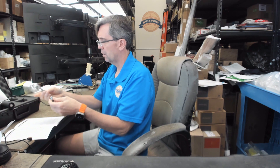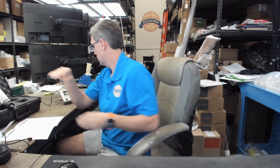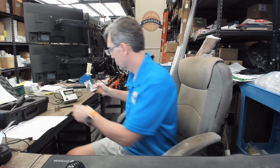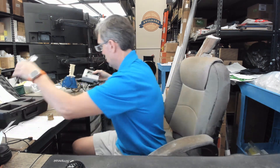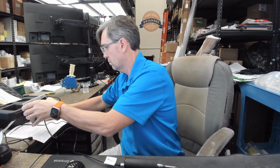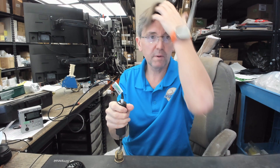There are two tips — looks like there's a number one and a number two. I don't know if that's still going to be too large. So we've got a cylinder here — it's a Kaba Ilco 7185 CB1, just an inch and an eighth mortise cylinder. A couple of screws are on here. I believe these are tighter than they really need to be. I've got this in peak mode, and the number one and number two tip in that screwdriver works just fine.